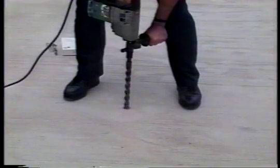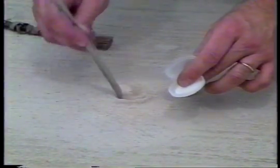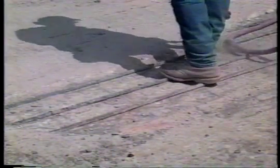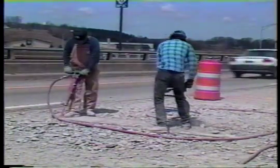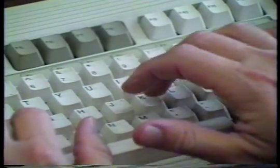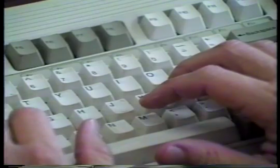Sampling for chloride analysis is another widely used measurement in deck surveys. Powder samples are obtained using an impact hammer and are then analyzed in a laboratory. Samples can also be analyzed in the field using a new technique developed by Sharp. Chloride contents in excess of one to two pounds per cubic yard of concrete are usually sufficient to initiate corrosion of rebar steel. Some agencies may require removal of all chloride contaminated concrete prior to installation of an overlay, which will prolong the life of the overlay because corrosion will not continue in the absence of chloride. All of these measurements can be used in a decision model to determine the most cost-effective strategy for deck rehabilitation, and this computer-based model is available from Sharp.